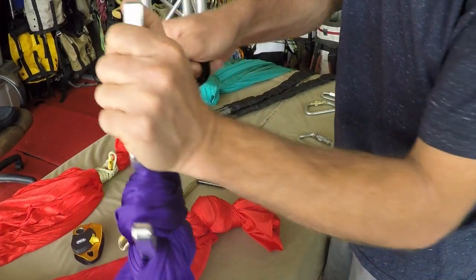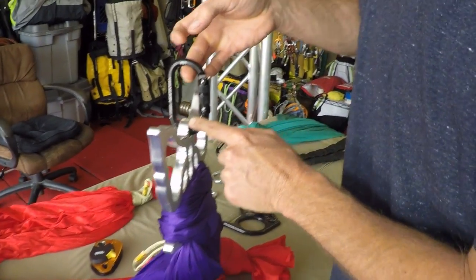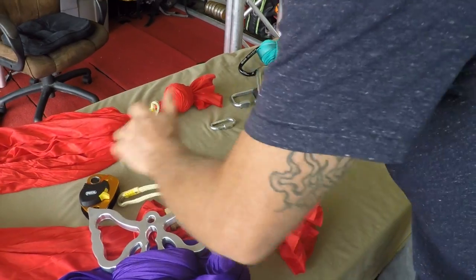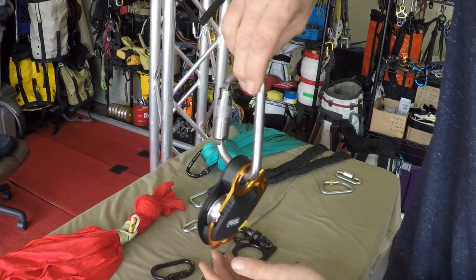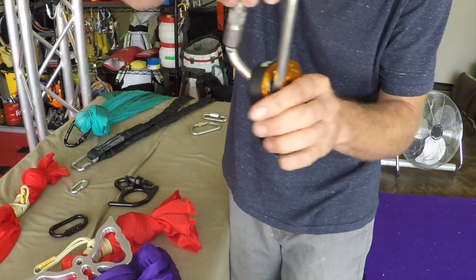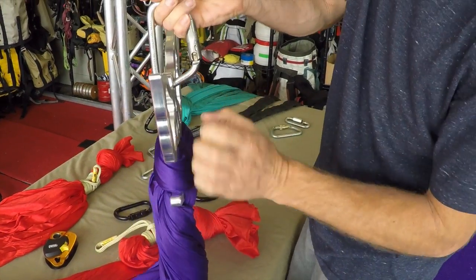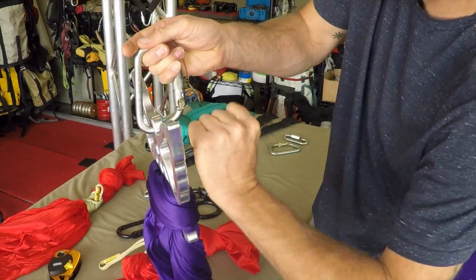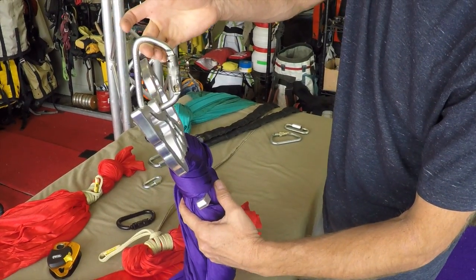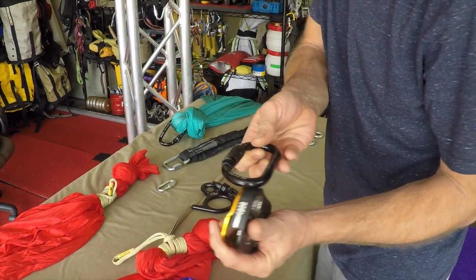The idea is that the hardware will sit symmetrically parallel with the spine and the gate — that's why we're still using oval carabiners, even though they're a few hundred pounds weaker. This is a nice thick piece of aluminum, 6000 series, half an inch thick. It won't sit symmetrically inside a D-shaped carabiner. You can see how the side plates are not parallel with the spine, and that's detrimental. It causes uneven loading — an off-axis tilt — which introduces torque from the nose up the spine, and these carabiners essentially just twist right apart. That's one reason why the oval is still a major player in the rigging world: its compatibility with wider types of hardware on the market.